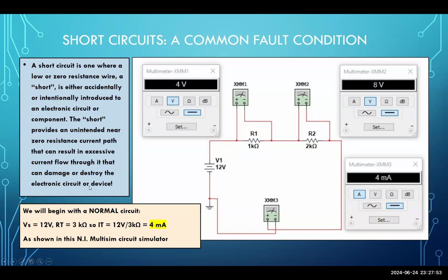Bad news, okay? So what we've got here is another software I'm using, and it goes to show I've got two resistors, and given the two resistors, normally with the 12-volt supply, I've got 2 voltmeters and an ammeter. And the voltmeter number 1 across this one shows 4 volts. Voltmeter number 2 shows 8 volts. You should verify whether or not these make sense.